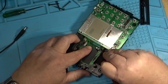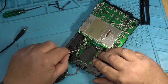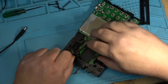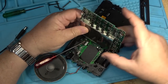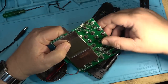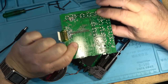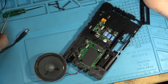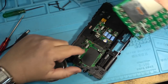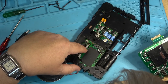Lift up the clip here and see. See, this radio doesn't turn on at all, so they may have a totally different problem. They may have a problem in the logic board on this one. So something interesting to try would be to try the logic board from the other radio and just see whether this one's working. It looks like someone's changed that cap.